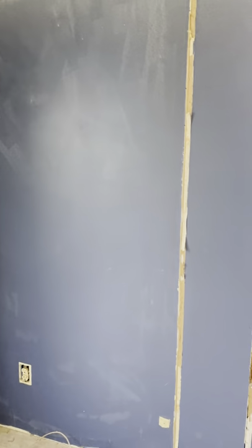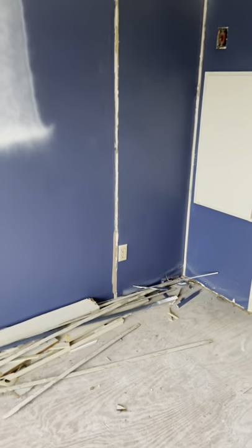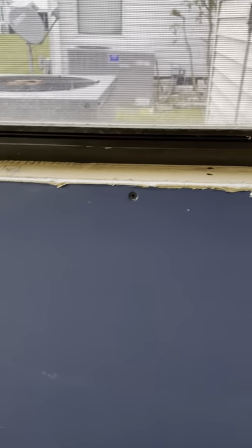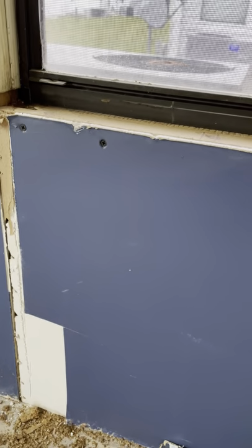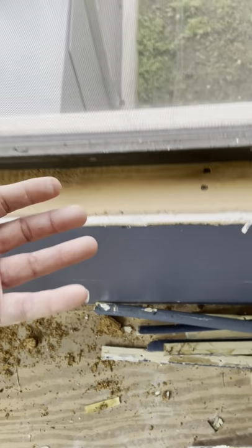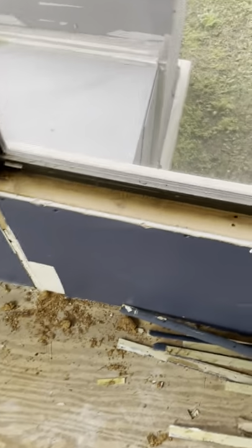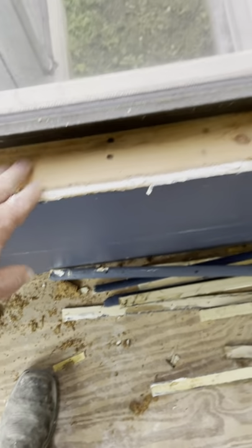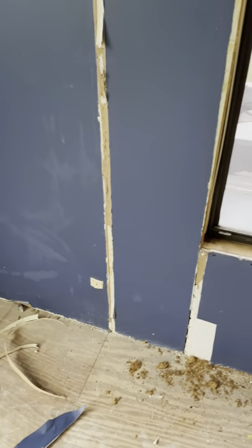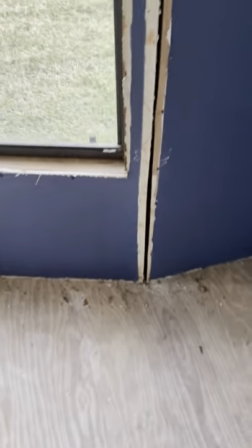And I started working in this room a little bit today, but I haven't really spent a lot of time in this room other than fixing the ledges. So you can see what I did is I just put dry sheetrock net screws in, because again, this gap right here was huge. And then that hot air or cold air would come up, and obviously you can see there's no silicone, so it would just sweat. And that probably also contributed to it. So that's fixed now.